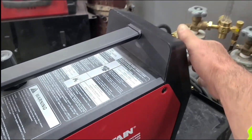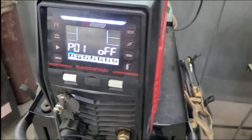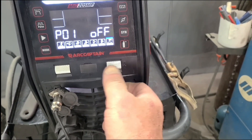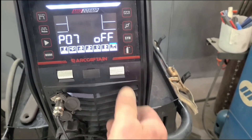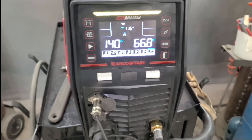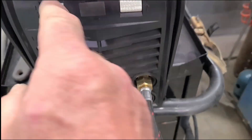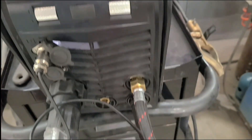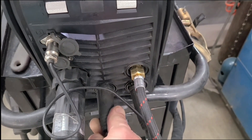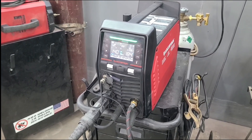The information on this is available in the manual. You turn it on, press the upper left button, then press it again — you're now in engineering mode. The setting you want is P07, which is the voice. Hit mode and it goes back to P01; navigate back to P07, use the knob on the right to flip it off, and hit sync. When you hit sync it returns to regular welding mode and it doesn't talk anymore. I just turned the voice off. I think it's awesome that there are so many adjustable settings in engineering mode — there's a lot more I want to learn about this machine. I tested it and it does not talk anymore. If I want it to talk again I can turn it back on; if I want it to shut up, I can leave it off. It's just awesome that you have that option.